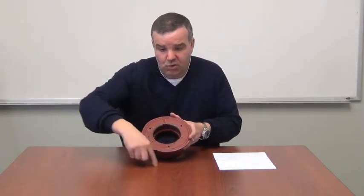We made ours 8 inches so that if somebody is doing a tenant improvement job — a TI job — with an 8-inch core drill they can cut an 8-inch hole into the ground and this will fit in. We've had contractors say that makes this easier to work with.